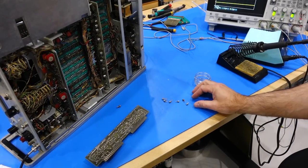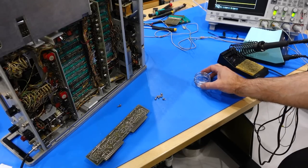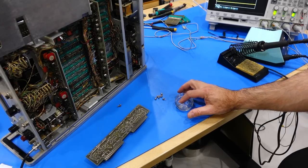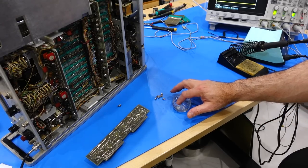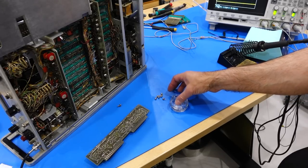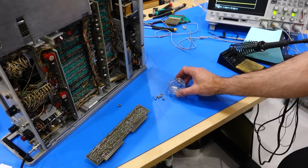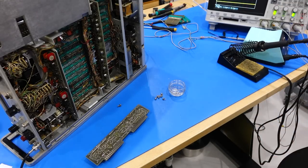So in the end, what was it? Well, lots of bad transistors. I don't know why. So we have 6 bad ones. Totally dead 2 that I changed because one I had to match them, and the other one I thought was low gain, but I think it would have worked because it was the reset in the end in the flip-flop.